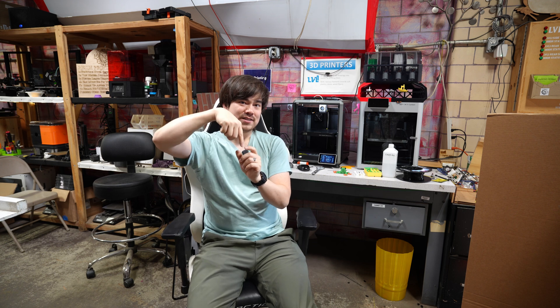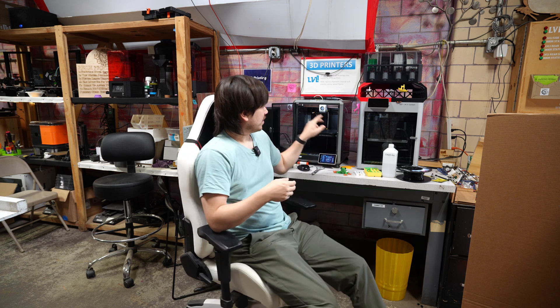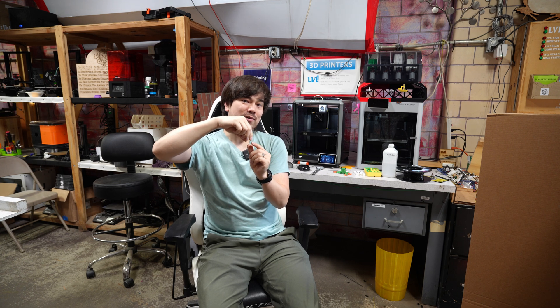You never want to be in that situation. Also, when you have the hot end, heat sink, and nozzle all separate as independent parts — like in older Ender 3s and older printers in general — you can run into the issue where a nozzle clog causes a large buildup of pressure in the heater block, which then squeezes filament out and causes the 'blob of death' failure, where you get a blob of molten plastic inside the printhead shroud that solidifies into a giant block and you basically have to replace the entire hot end. That's much less likely to happen with newer designs — the Prusa MK4, Creality printers, and Bambu Lab printers have all moved to the newer style with a monolithic nozzle and heat break, and in the case of Bambu Lab, the heat sink is attached as well.